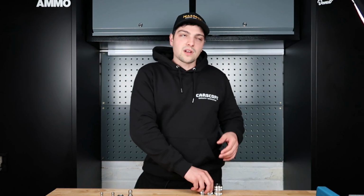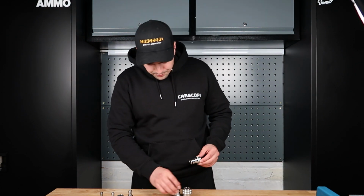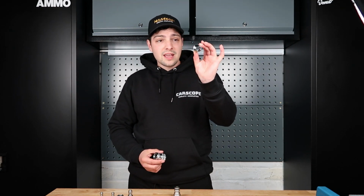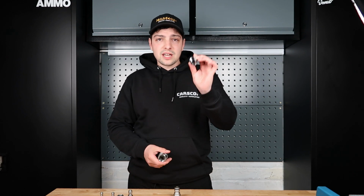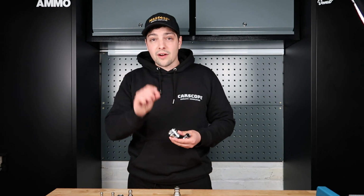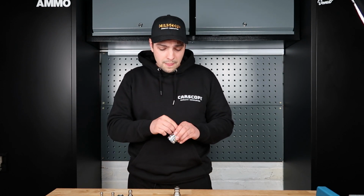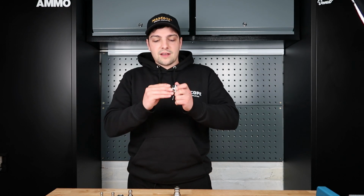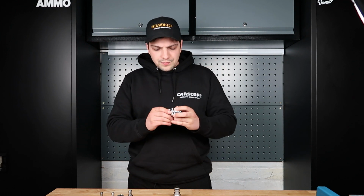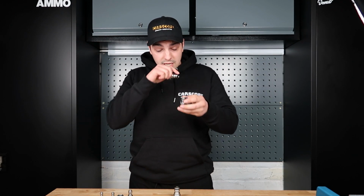Now, that takes me on to our low flow connectors, if you like. So we use these things for like bucket fillers, or if you're upgrading your garden hose setting. Now, these are made by Nito. They're nickel plated brass, but the reason I love them so much is because the diameter is 3/4 inch rather than 1/2 inch. Now, this is the only company I found that makes this. Most hose lock connectors on the market are a 1/2 inch, so quite a narrow orifice, which I'm sure you're seeing, the plastic ones or the brass ones. Now, these are nice and hardy, and you get a good positive click together. Got O-rings on it as well, and it allows for a much higher flow due to that larger internal diameter.